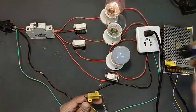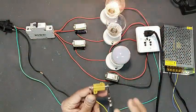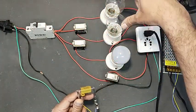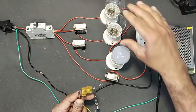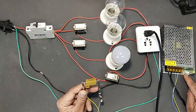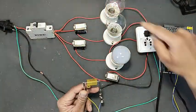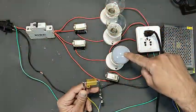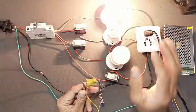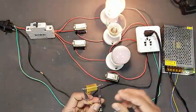I will demonstrate — in this power supply I have a short circuit at the input circuit, and we will check it. Now I verified that this load is working good. In this condition I can turn on the second switch so these two lamps are now in parallel, providing enough current for this power supply. The LED light is now stable. You can use 60 watt, 100 watt, or 200 watt lamps — that's also good. The same configuration I am using in my workbench, but this time I organized it on the table to give a clear concept.